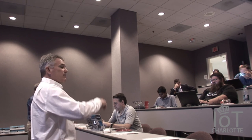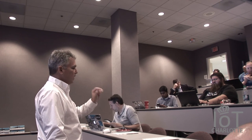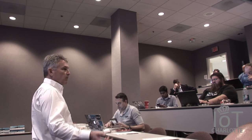The final way is you look at what you've got, it doesn't fit with any of the existing profiles, and you go, I need to do my own customized profile. This is not very difficult, right? You're basically just listing what you need to send and how it's going to be sent, what format and the rest of it. It's basically just a table of a structure of attributes. You can go look at the Bluetooth SIG website, and there's Bluetooth Developer Studio, and it will help you create a custom profile if you want to. It's very straightforward.